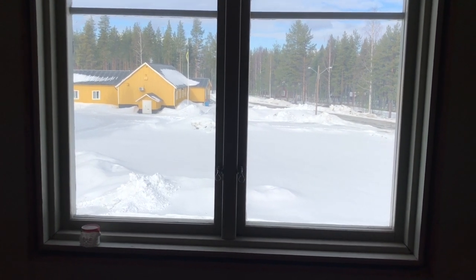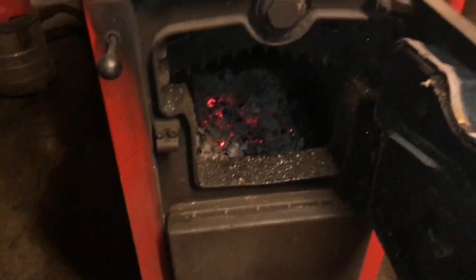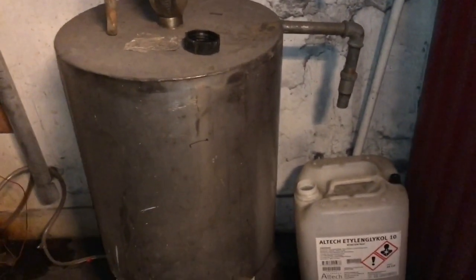I'm not sure whether that's a good idea or not, but it's what I've got to do. This morning was so cold - we're in double minus digits overnight. I had to light the boiler, so now I've got to let the furnace boiler go out and turn off the water. Let's go down into the cellar. It'll show you the three radiators in this room that have got to come off. Here we are in the furnace room and the furnace should be just about out. For those of you who've been down here before, some of this will look familiar. We put this tank in, which all seemed like a really good idea. I think I could drain the system back through this tank and out of the overflow pipe. Let's have a go and see if we can crack these valves first.